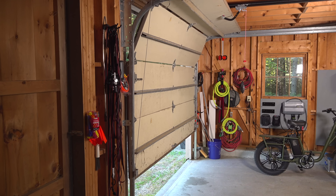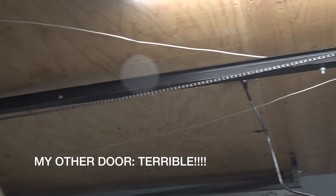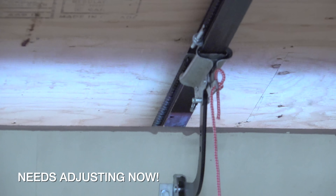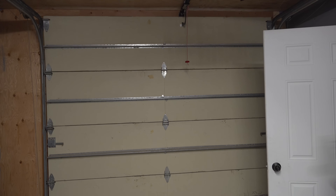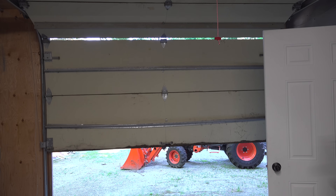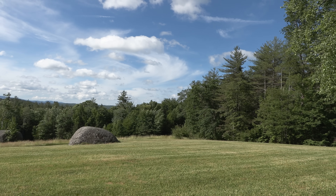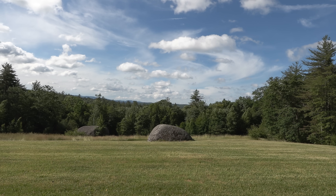This single adjustment is one of the most commonly overlooked items and it's so easy to diagnose. Just go in your garage, look up at your chain, and make sure you've got the correct sag in the middle — but it definitely should not be going below the rail, like one of my doors as you can see here. Whoever installed this garage door opener didn't really know what they were doing — my other door was so bad that the trolley was actually breaking free and dropping the door in the middle of opening. So if every time you push that garage door opener you're saying a prayer because it sounds terrible, take a second to look up at that chain and make sure it's adjusted correctly. I hope this video was helpful — if you liked it please give me a thumbs up and subscribe to my channel for more videos coming up.